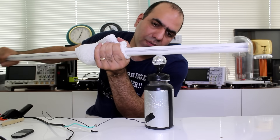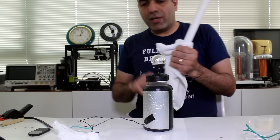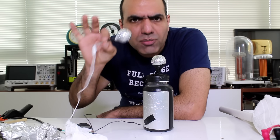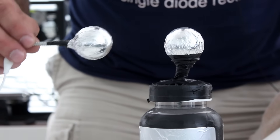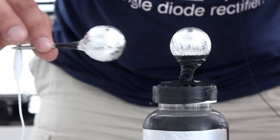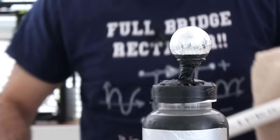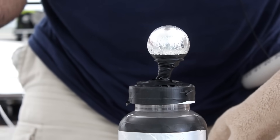This is very much the same way a Van de Graaff machine works. After 10 strokes, there's a little discharge — looks like about 1 kilovolt. 20 strokes gives a better arc, probably around 5 kilovolts. 50 strokes — that was strong, maybe around 10 kilovolts. And 100 strokes produced what looked like 15–16 kilovolts.